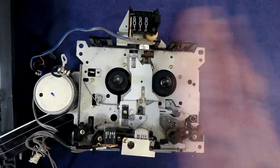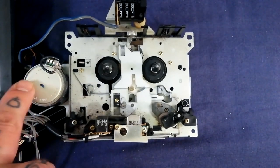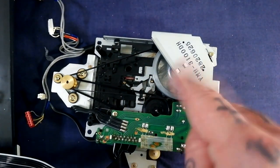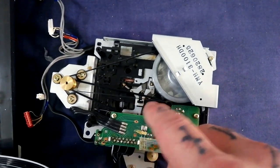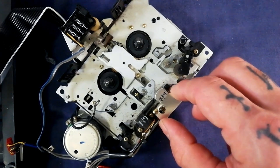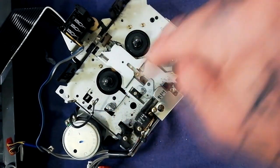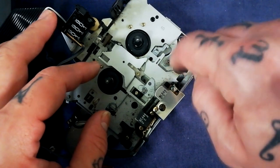We've got a single motor here - because of the black covering I can't see exactly what the model is, but it's likely to be the same motor as in equivalent-speed multi-trackers from Tascam. There's a double pulley - one going via a flat belt to the flywheel turning the capstan, and another going to a wheel that turns the reel mechanism. The transport does three things: raising and lowering the magnetic heads and pinch roller is function one. When the pinch roller gets the tape between it and the capstan, the rotation draws the tape across the heads at steady speed in playback and record modes - that's function two, the turning of the capstan.